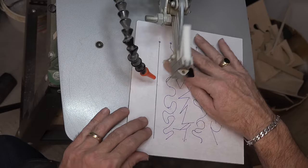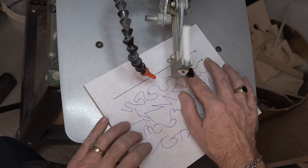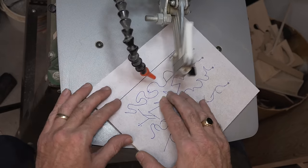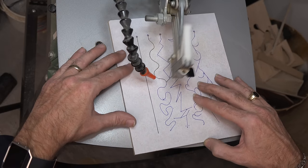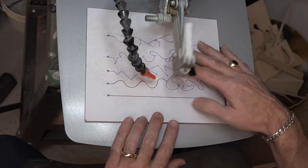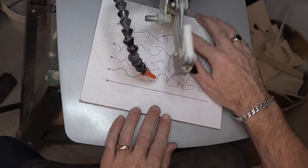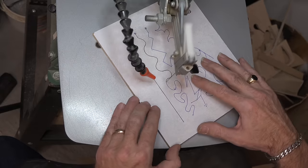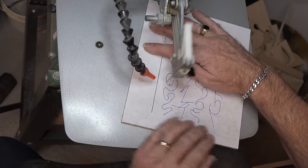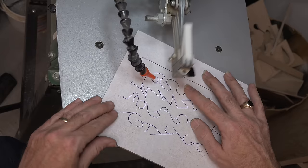This one here is kind of circular, so again feed rate and rotation rate will be equal. It's not a perfect circle by any means but it's more of a circle than a gentle curve. Coming around here we're going to get into some strange shapes — this tighter curve means rotation rate faster than feed, then a sweeping curve means faster feed with slower rotation, and that goes directly into two tight curves in a row.